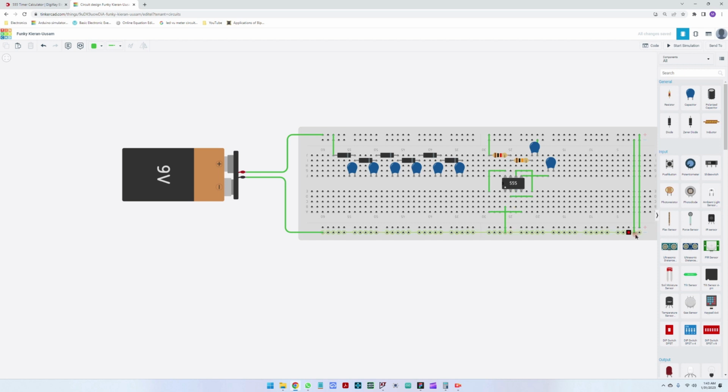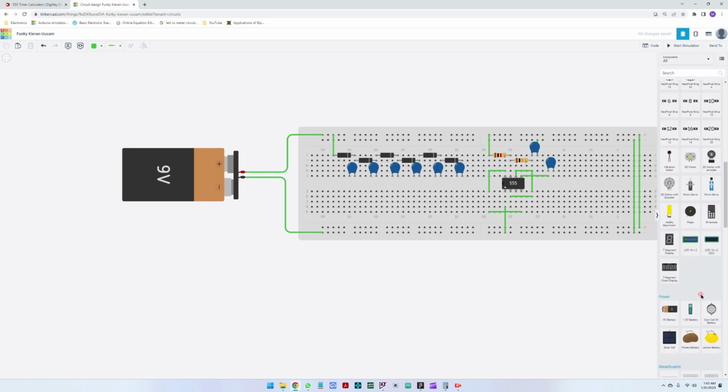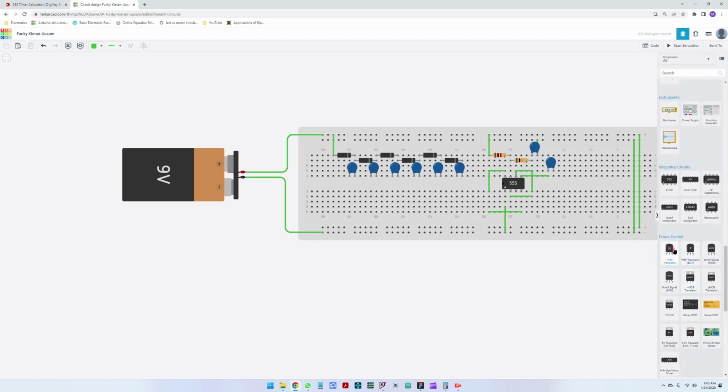So in the first step, let's see how we can add the FET transistors or the simple bipolar transistors. So I'm going to add two transistors, the base of both of the transistors. So this is an NPN and a PNP transistor. So the collector from the NPN is going to the supply. The bases go together. Okay, I need to connect this to here. Okay, the emitter from the NPN goes to the emitter of the PNP, and the collector from the PNP goes to ground.